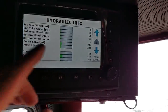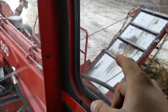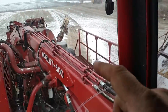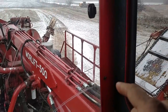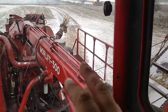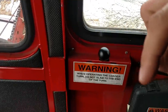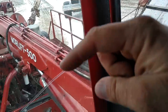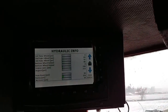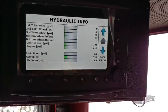The bottom feed wheel output — I've got two feed wheels before I get to the conveyor. So underneath me are two feed wheels on the bottom, and then there's three on the other side of that conveyor. They call that the input bottom feed wheels and that's the output bottom feed wheels. I have that same transducer for that one out too. I've replaced a couple transducers on this — Morbark did when it was under warranty. So there's two of my little problems.